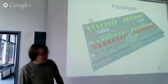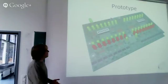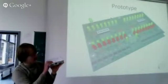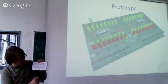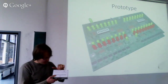I produced a prototype. It looks like this. I'll show it in action later. Here on the back side, there is the interface from the Raspberry, and in the front there are the 2 ports for the automation system. Here are the LEDs for the outputs and for the errors. Here are 2 LEDs showing that the 24-volt power supply is connected, and here are the inputs.